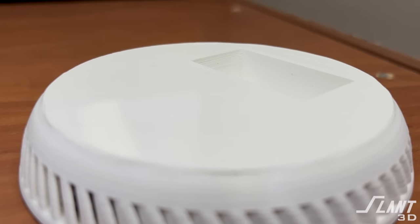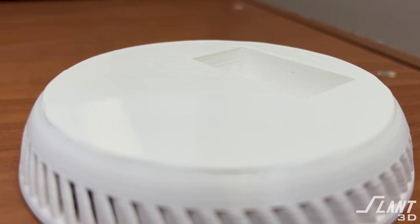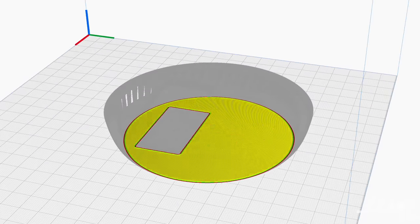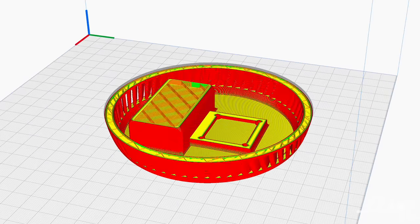That's basically how the bottom layer is made. It is a little unhandy because you have a large broad surface against the bed, making the bottom surface prone to errors. This might not be a big issue since you could paint the entire unit to address any staining or deformation, and it's also a non-customer-facing part. Ideally, we would add cavities similar to the battery hole so the bottom layer has as minimum surface area as possible to minimize those types of errors. The individual standoffs and features would be designed for printing individually.